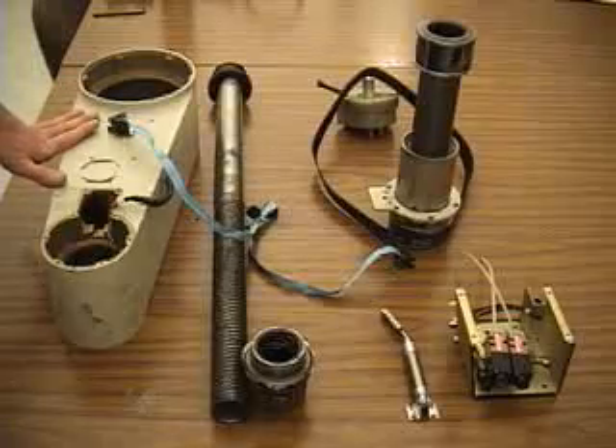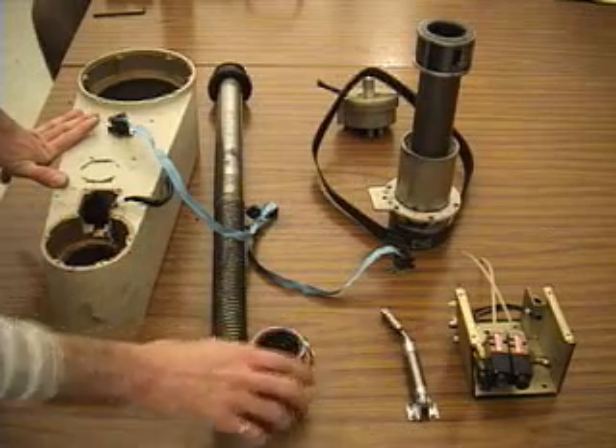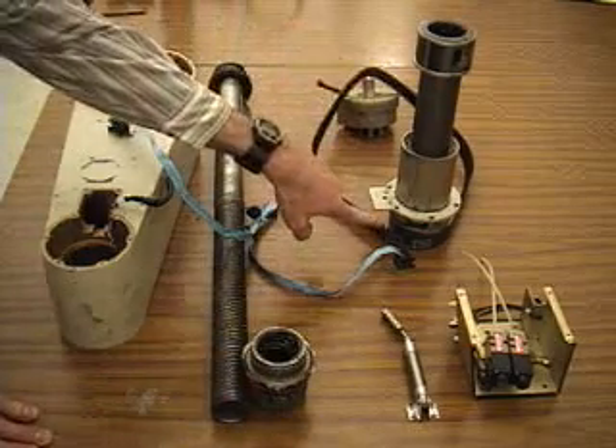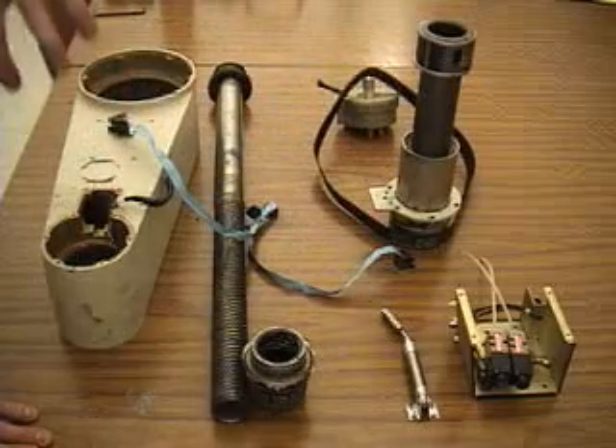Here's the forearm on the robot. It has a ball screw that penetrates through one end, and there are two actuators here. There's a stepper motor that's belt-driven to this larger pulley here, which makes the whole vertical assembly turn.